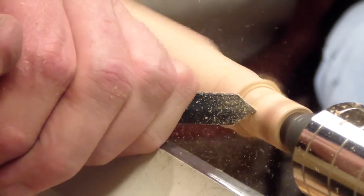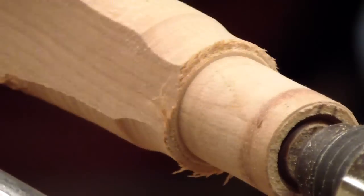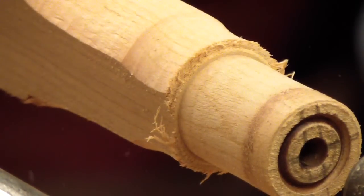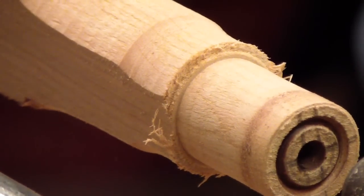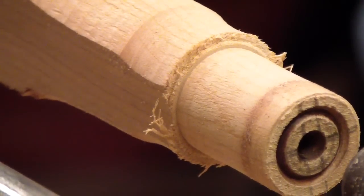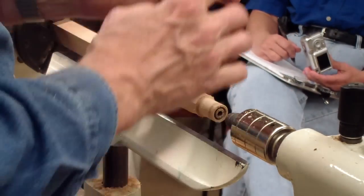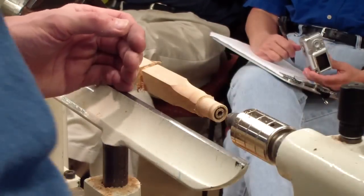Guys that I do furniture repair parts for that know really like this. The ones that don't know, they're not too happy about it. You cannot put the glue on this and stand there and talk for 5 minutes. You get the glue on it and put it together, because it's just like the biscuits, it's been compressed. So when you're cleaning out that 3/4 inch hole in the chair, and it was bigger than 3/4, because this is compressed, it takes up some of that slack. If it's a decent chair in the first place, even if it's an exact 3/4, it just locks that much more tightly. So it works pretty well.